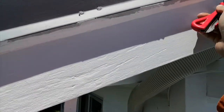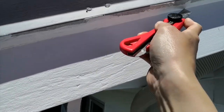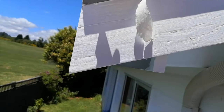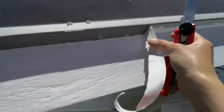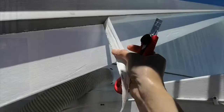Number six — masking. Put masking on and remove it on the same day. If you leave it on for too long, the sticky residue and glue in the masking tape will dry up, and when you're peeling it off you risk peeling the paint underneath as well. Pro tip: you can remove sticky residue from masking tape with thinner.